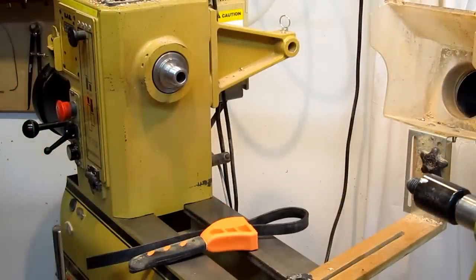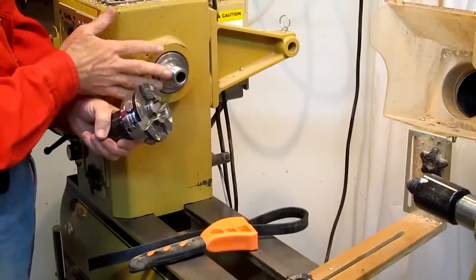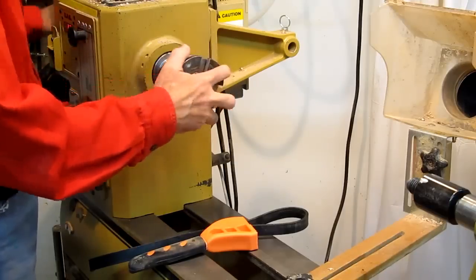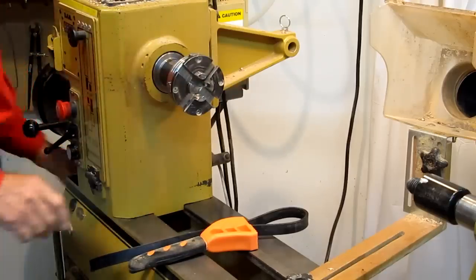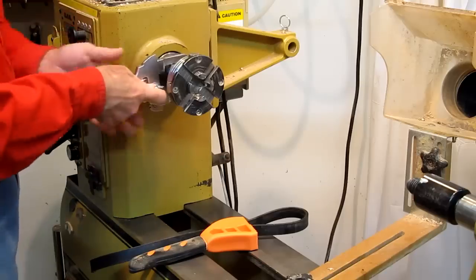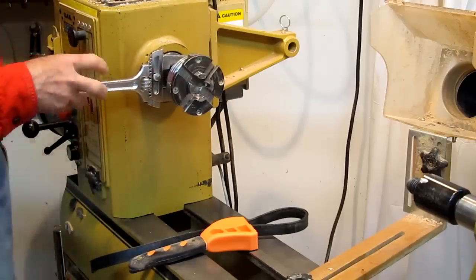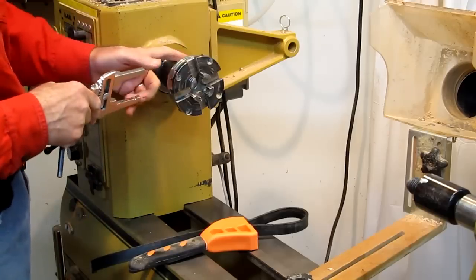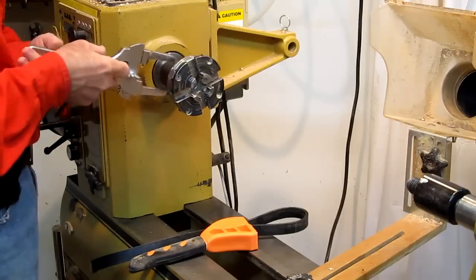Let me show you a couple of examples of wrenches I use. I use a spindle adapter to go from my one and a quarter inch thread on my Powermatic to a one inch thread on a smaller set of jaws. Occasionally I'll have a need to take this off, and it's hard to grasp. I found an inexpensive plumbing wrench called a slip-lock locknut wrench that works just great for this. Then I can hold this in place and get one of the Tommy bars to help leverage it and break it free without any trouble. It's not an expensive wrench, not very precise, but it's good enough to get the job done.